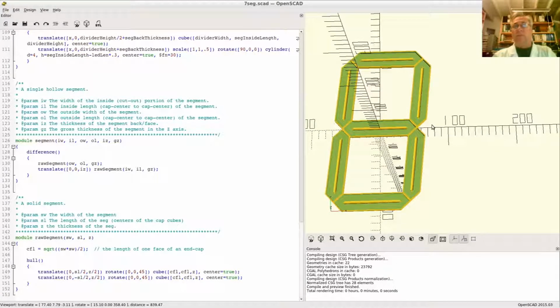If you have an even number of strips, like I do here in a 2x5, I call this 2 strips by 5 LEDs in each one, you would need to bring the wires for the power and the data in here. Now the way I wired mine is I connected up to this first strip right here, and then the first strip I connected to the second one here, and I go around in this order, around the inside of the top of the final shape. Then I come over here and I go around the outside of the bottom like this.